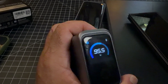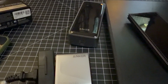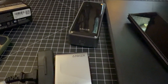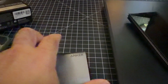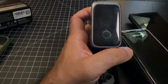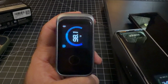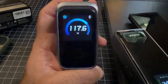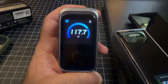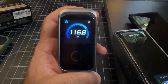Now I want to push this to its limit. I'm going to plug in another cable and charge the battery backup itself to see how much power it draws — because I think the battery will ask for more power. After plugging in and renegotiating power, we're seeing 115 to 117 watts. I've seen it go up to 140 watts depending on device demand. That's pretty impressive for something this small.